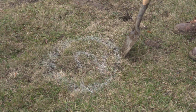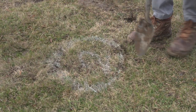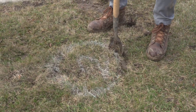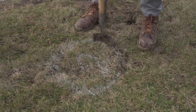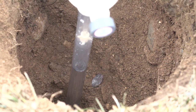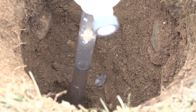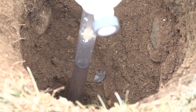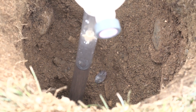You can use a shovel to remove grass and topsoil and expose the native soils. If the infiltration testing will be performed deeper than about 1 meter below surface, you may need to use mechanical equipment for digging. The Guelph permeameter can only extend to depths of approximately 75 cm below surface. A depth attachment can extend to 315 cm below surface, but note that it is very difficult to hand excavate an auger to that depth.